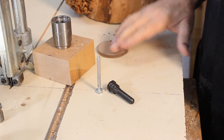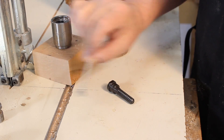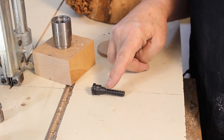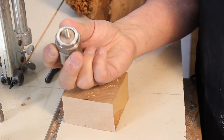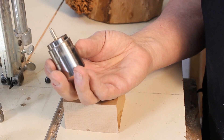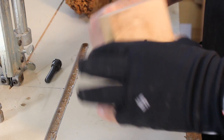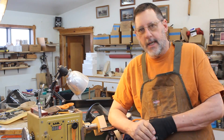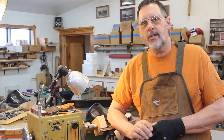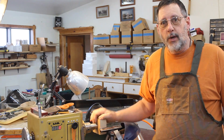If you choose to do such a project, you need to select a screw. I would look at a lag screw with really heavy threads. For this project I'm going to use a screw thread that came with one of my chucks — it's nice and long. I've got this block of wood chucked up into one of my screw chucks, I think it's a Beale. I'll take it to one of the lathes, make it round, and use that center hole throughout the project to make sure I'm centered up. I did a little research on YouTube on making a screw chuck, and I'm going to throw in a few things I didn't see there. Let's readjust the camera and get to work.